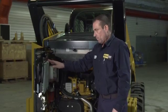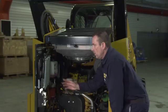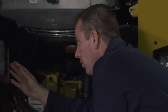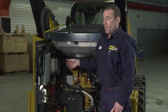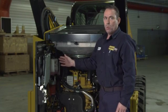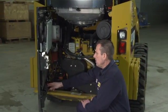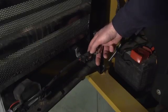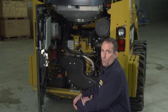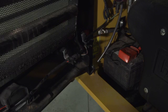This is our air conditioning condenser. Any kind of restriction in our condenser is going to restrict the flow of air inside your cab. You want to make sure your condenser is clean — you can see right through it for debris. If there is debris clogging the condenser, clean it with low pressure air or a garden hose with low water pressure. Below our condenser is our backup alarm. In the past it was hardwired; we now have a two-pin Deutsch connector which we can disconnect for early morning loading or unloading, then reconnect once the work is done.